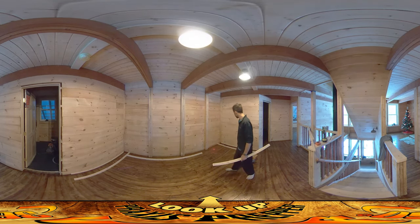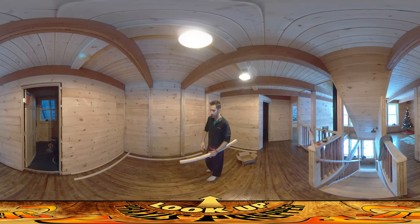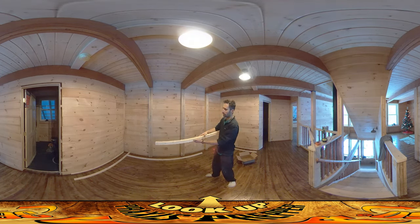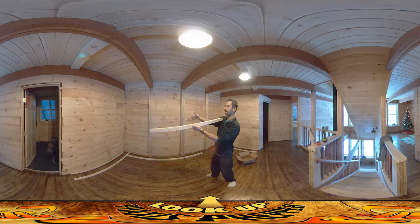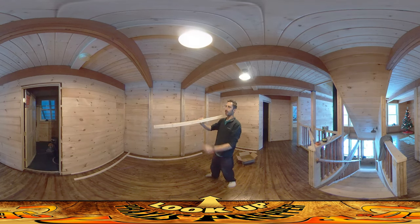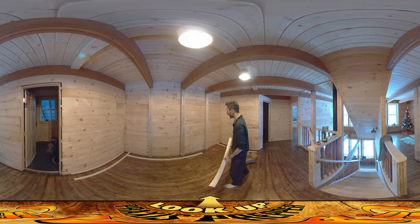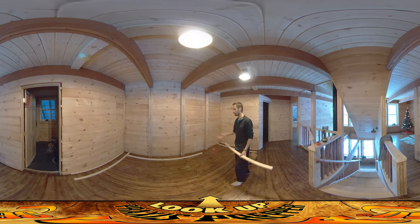What you can see in front of you here are the bases of the shelves. I don't want books directly down on the floor, so I'm using these one-and-a-half inch boards on the floor, and then the three-quarter inch board shelves — I'm using ten-inch deep shelves — are going to sit on top of here. So the first row of books will be about two and a quarter inches up off the floor. I'd like it a little bit higher maybe, but these one-and-a-half inch boards connect down really well and it's all just extra scrap I had. Balancing what I've got as scrap and ease of installation with height off the ground, I've determined this is going to be just fine.